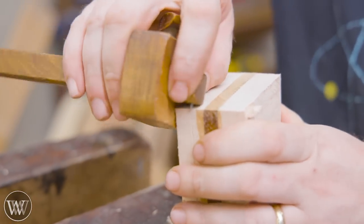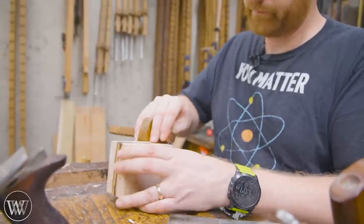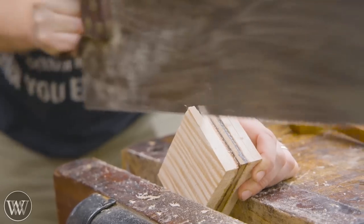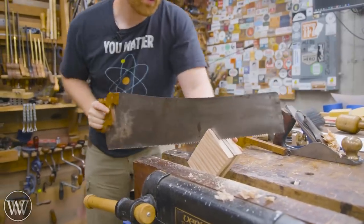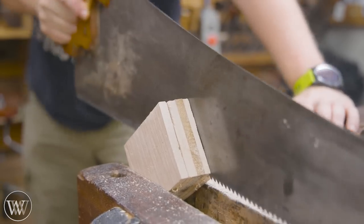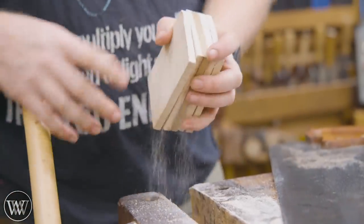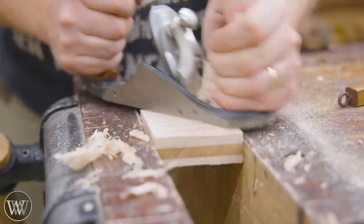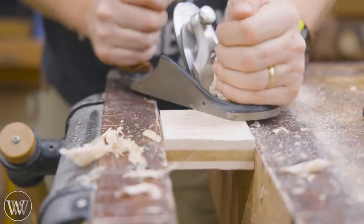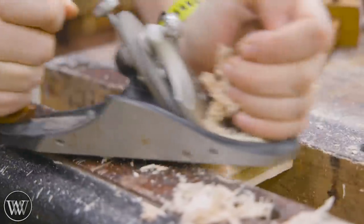I need to take off a decent amount of material. I'm going to want the final thickness to be about seven-eighths of an inch — some people like it a little fatter, some thinner, usually between three-quarter and one inch for tote thickness. I like mine at about seven-eighths right down the middle, so I'm cutting a little bit oversize and then planing it down nice and smooth. That is the blank I'm going to be pulling it out of. Once it's all cut apart, I can smooth it off and save those other pieces in the scrap box.